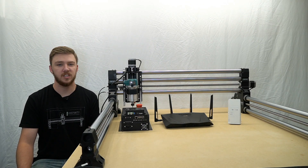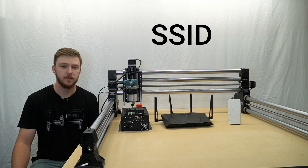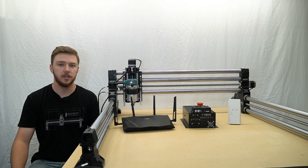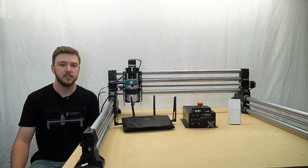The first thing we need to know when setting up our Onefinity through a wireless network is the SSID, which is what's commonly referred to as your network name. Every router's SSID is different, and you'll need to know that SSID prior to hooking it up to the Onefinity. For example, our ASUS router came with the default name ASUS 2.4, but we've renamed it to SHOP.